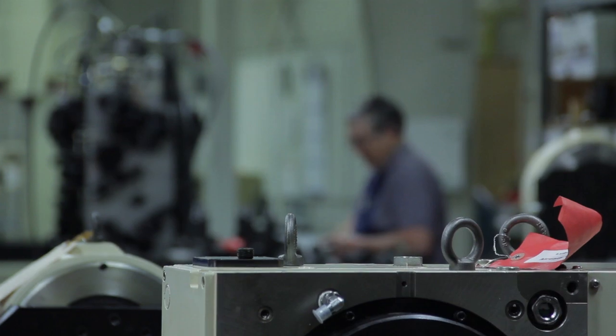We also build fully automated robotic cells, and this customer has several of them as well — a full production line where the part comes out of another machine. A robot brings it off an infeed conveyor, they do thread detection, press the components, do a pin stamping, and the robots put the knuckle onto an exit conveyor. This is all done in less than 50 seconds, compared to the three-minute cycle time on this machine.